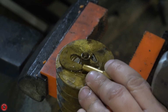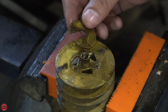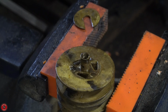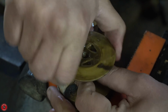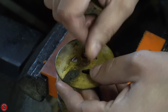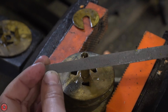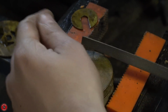So usually I keep them around. I'll just repaint it. This little brass clip thing, there's two on either side. I guess that's all that held this entire thing together. But I will remake those because they're kind of worn and a little flimsy. So each metal disc, or I guess brass disc, has these grooves cut into them, almost like teeth, but not really fully pointed at the end. They're much more flat. It's almost like they just cut grooves into the end, or lightly knurled, let's say, would be a better description of what's going on.